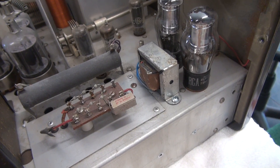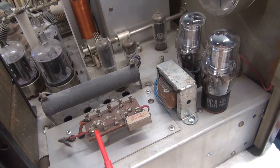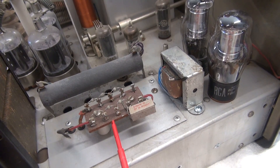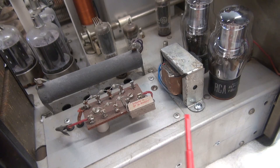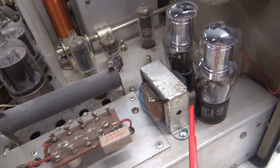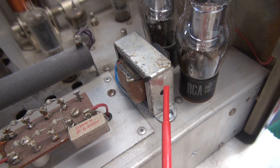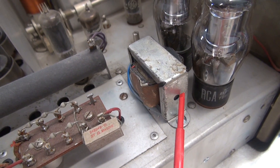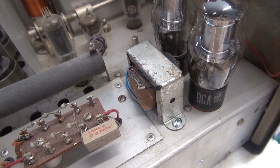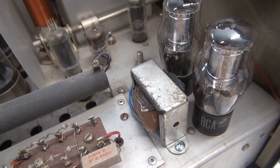Here's the top side of the Valiant. Normally there would have been a pair of 866 rectifier tubes here, but somebody in the past put in a little rectifier board, which appears to work fine. The Valiant tunes up very nicely and smoothly, so I'm going to leave that. This here is the new push-to-talk power transformer, and that feeds our little board underneath. I'm going to cut to the schematic of the board so you can see how it's wired, in case you come across a Valiant like this or want to add a push-to-talk system to some other transmitter.